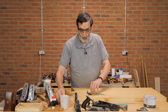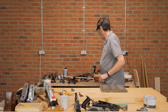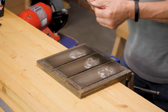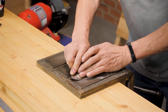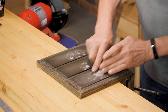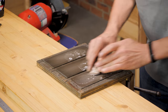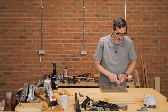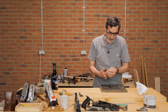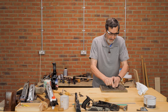Now we're ready for what we're probably more familiar with — we're going to hone this bevel. I'm going to show you a technique you may never have seen before, two methods. There's my bevel. I can either roll this way across the bevel, but I prefer this figure-of-eight method: I start on this corner, push, and make a figure of eight. As I'm doing this I'm rotating the blade so every edge gets a continuous honing of that bevel. It works great — that's putting the initial bevel on, the actual cutting edge. I go all the way across corner to corner, then the same again on the other side. It's super fast.